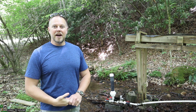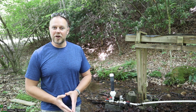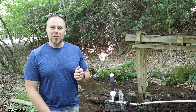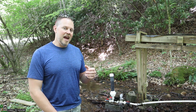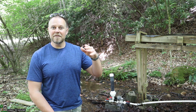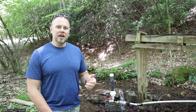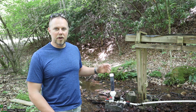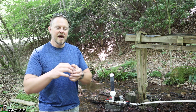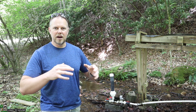Whenever I put this pump in about five years ago, I did a bunch of testing in the wintertime to see how it would react to freezing. And this year, when I turned the pump on, I realized the air that was in the pressure tank started to leave the tank quicker than normal, and the pump started to hit hard. By hitting hard, that means the ram pump does not have a cushion of air inside the pressure tank, and so every time the water hammer hits, the whole system jars real violently.